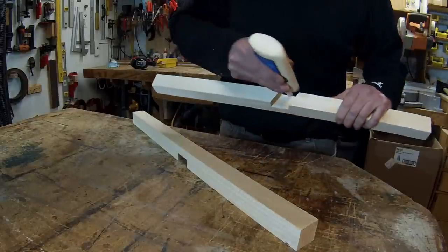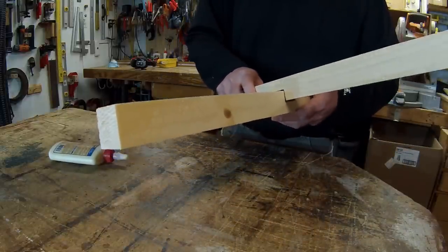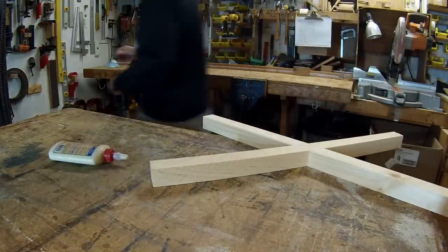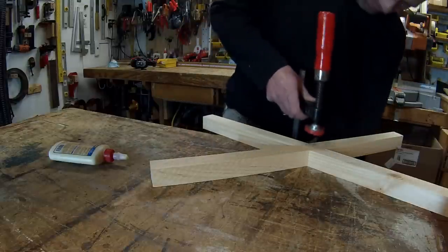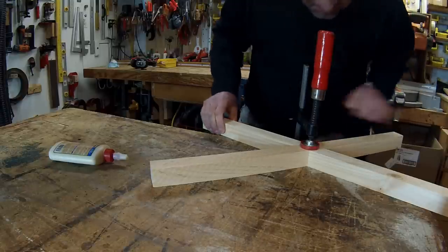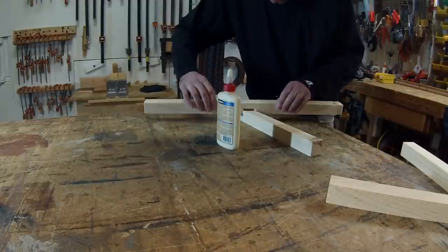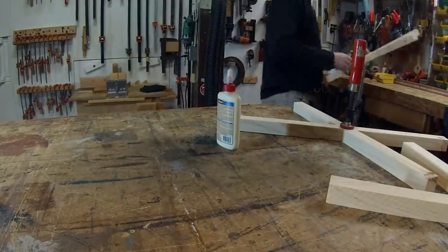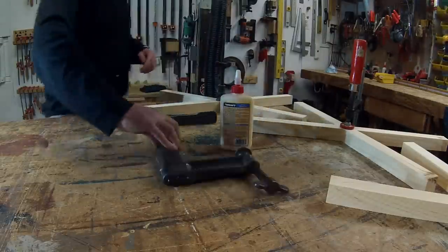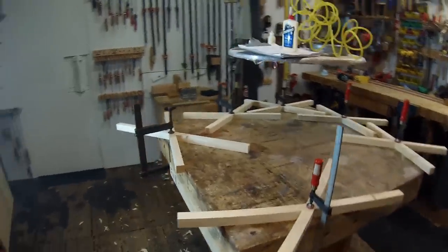This is the glue-up. I just need a little bit of glue on the bottom of the channel to attach these frames permanently together. I'm doing a natural finish on this piece of furniture, which means I have to be especially careful with how much glue I apply — too much squeeze-out can smear and ruin the finish. I have to apply just the right amount and minimize it, ideally eliminate it altogether. These joints don't need to be glued at every surface; just a little bit to lock it together. The X's basically serve as a decorative element.